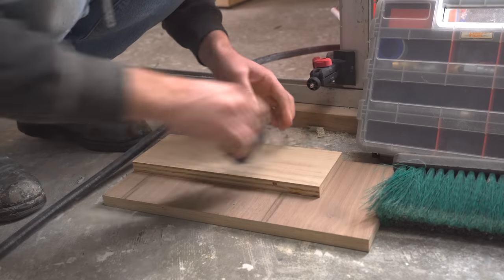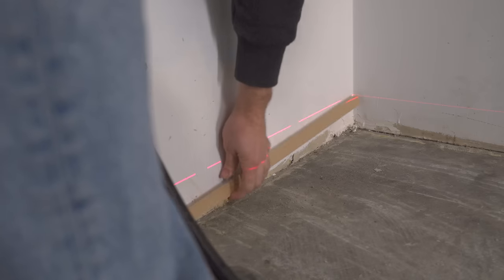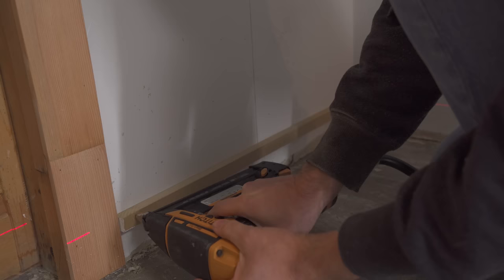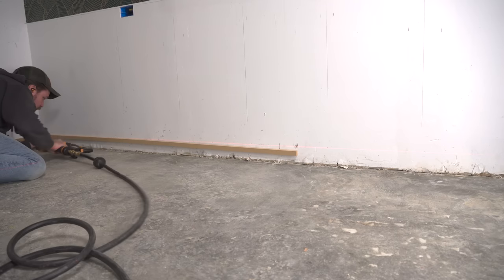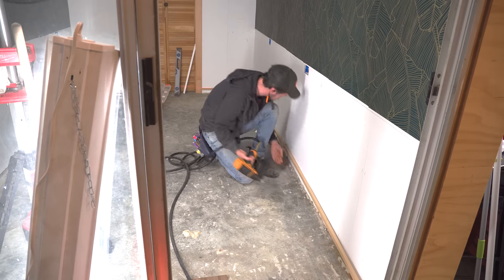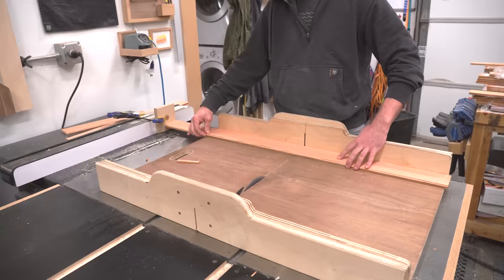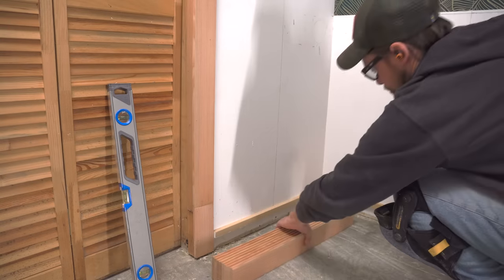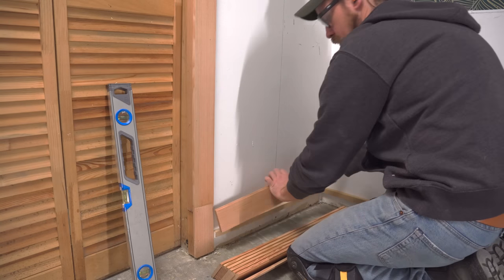With the floor clean, I could start in on the wood paneling. And for this, I'm gonna install a couple of MDF ledgers. The concrete floor isn't level, so the ledgers are gonna give me a level line to start from. I'm going a little bit taller than the first course, so I'll start on the second course when I get in there. This will allow me to put the baseboards in later and just slip them up into place. And even if there's a gap at the bottom of the floor, that's not gonna matter because when I put the carpet tiles in, it'll cover up that gap.